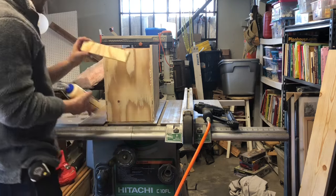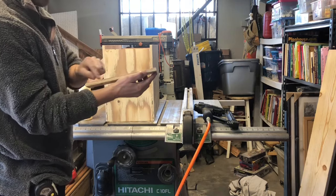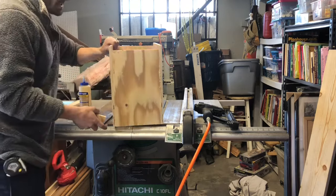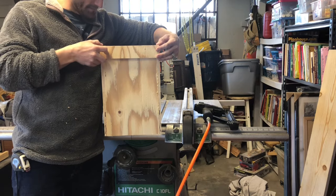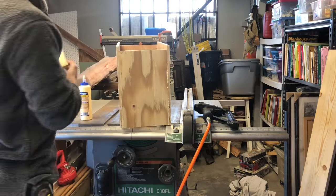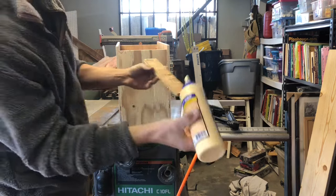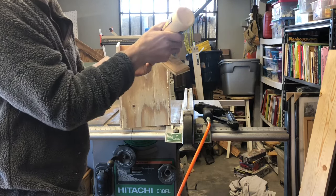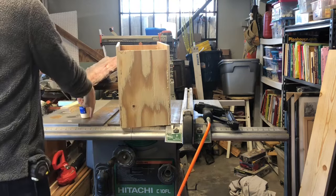And what you're going to do is you take that and you're going to put glue all along the back end of it, okay? Keep it away from about 1/2 inch up, so about the bottom half, that's where you add glue. And then what it does, if you can see the box here, you nail this cleat to the top edge, and that closes off the box so that there's a flat lid, and that makes your frame rest right there, okay? So we'll add some glue along the 2 side edges. So you want to be able to glue onto those 2 side edges, so we add glue here along the side edge and down the bottom and then up the other side edge, okay? So it'll look like that. That's how you add glue.